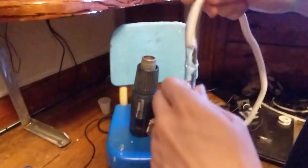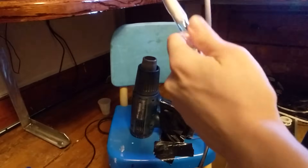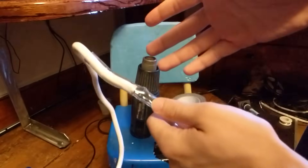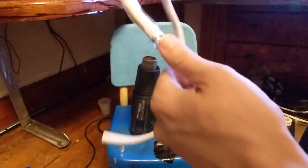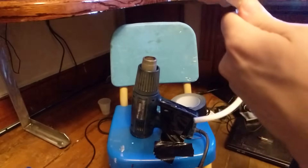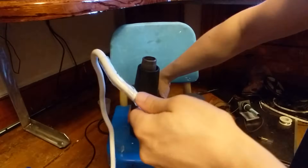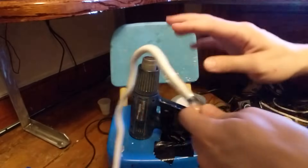Since this is the correct one it will work. You pretty much put it inside the tube that you want to bend. To make it go through, I usually just use Dawn dish soap — it's fine if it heats up, it'll just bubble up a little bit and it won't affect the tubing. Once it's in there, just put on the heat gun and put it on the lowest setting you can.